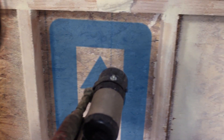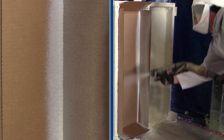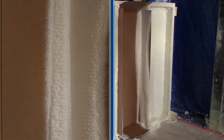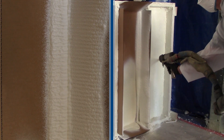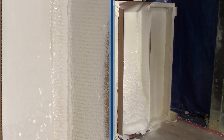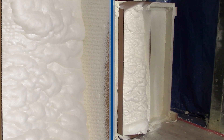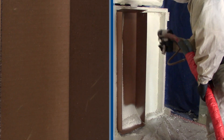The third technique is picture framing before the fill. With open cell foam, picture framing before is more widely used in cold weather applications to help insulate the open cell from the cold substrate. With closed cell foam, picture framing before is primarily used for a proper air sealing against the studs.